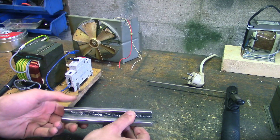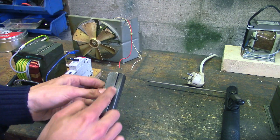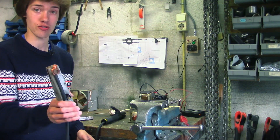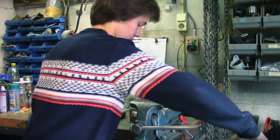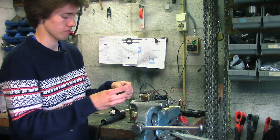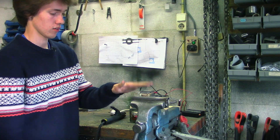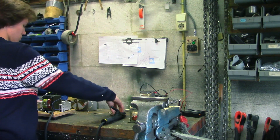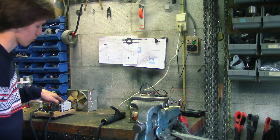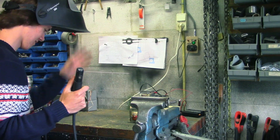So I'm going to put this thing in the bench vise, and then we're going to try and weld these two pieces together on this side over here. First I'll connect this clamp to the bench vise, then clamp the workpiece in place. Then we plug in the welding power supply, which I still have to turn on with this breaker switch over here.